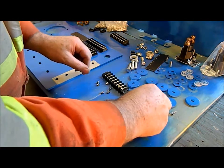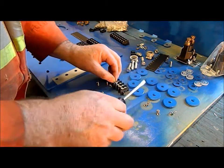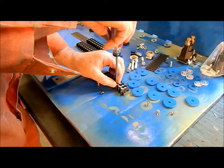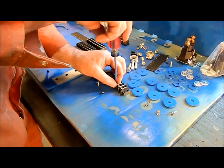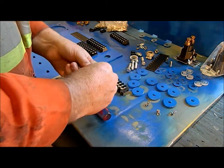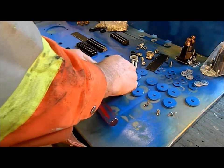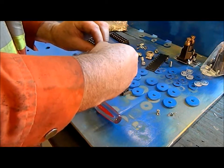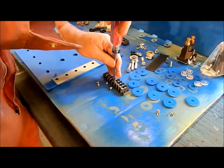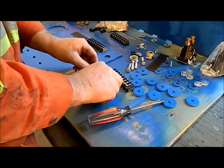We've got these little jumpers that go in between the barrier strip to common up all the negatives. On the bottom part of the man lift here, we've got probably 9 negatives to common up for the solenoids and for the contactors and things like that. So that's not right. Put that one in first. So that makes it nice and neat and tidy to have them all common. A bit tedious installing all these little bits.